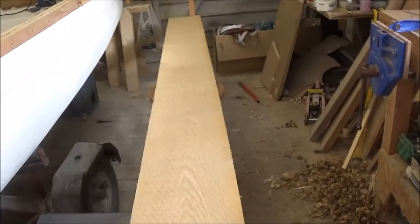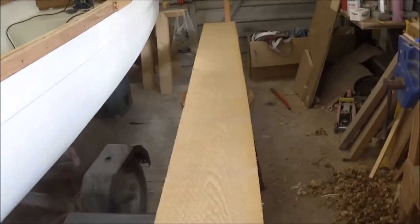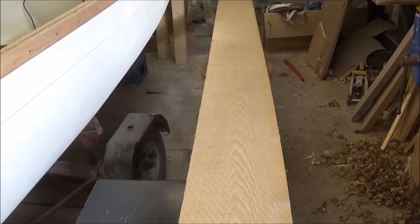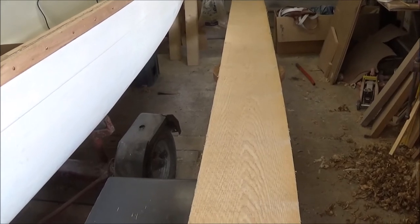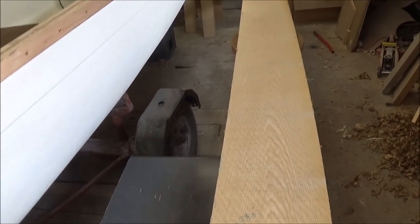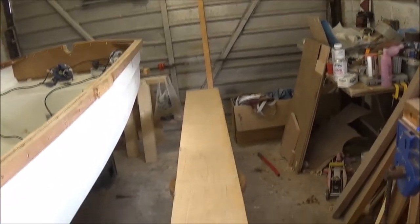So I've had to compromise a bit, but there is near-vertical grain down one side. The longest piece I want is for the keel, and it tapers from 90mm at one end to about 20mm at the other. I should be able to get a nice, near quarter-sawn, vertical-grained piece of wood for the keel, and I can fudge around with the bilge runners as well, out of this plank.